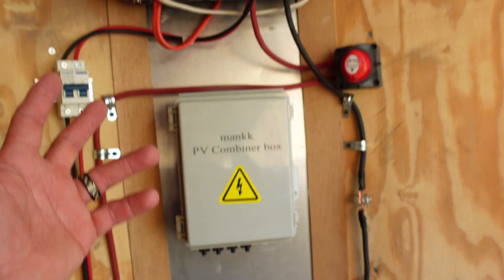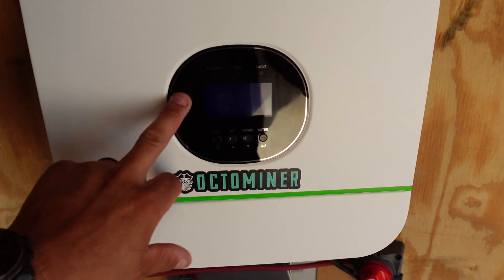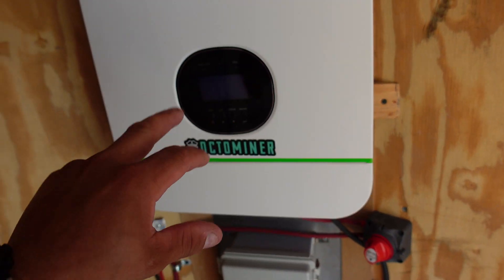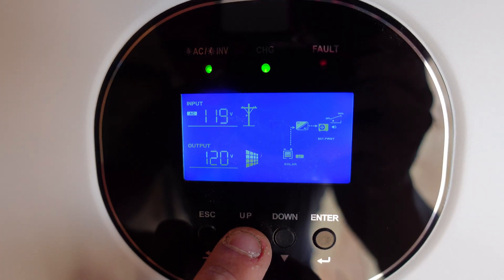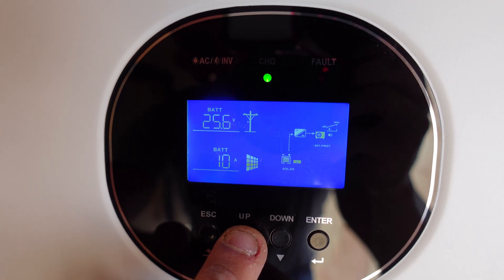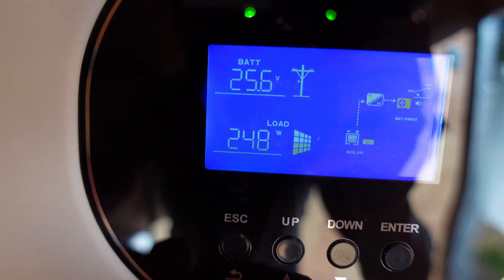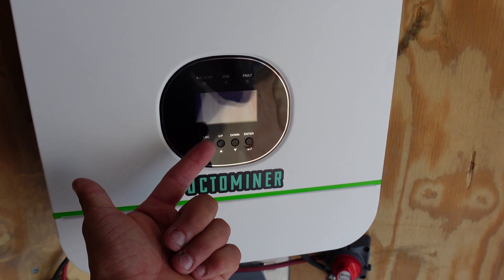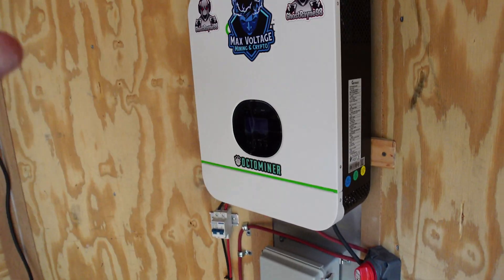It's testing at around 11 volts right now. Once it gets to 12 and together they're over 24 volts, this unit will kick back on. There's a setting I need to change — I was reading the manual last night and something's off, because it was only feeding from the batteries and never actually charging them back up, which is weird with the 120-volt grid or solar coming in.